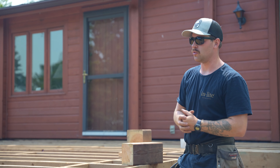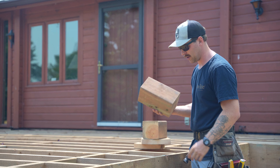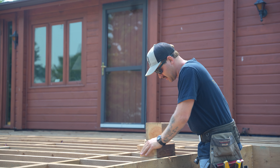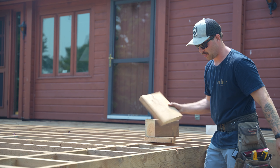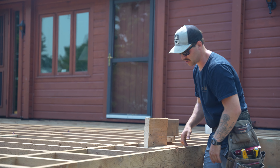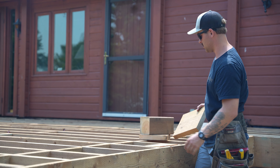I'm going around right now doing my post layout. We use a solid six by six block cut the exact width of the joist cavity. We'll install these blocks tight and follow up with another block on the back side. It's a nice secure structural connection, and later on we'll have plenty of meat to mount our railing posts into.